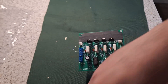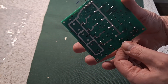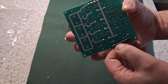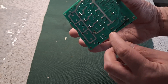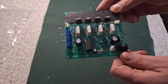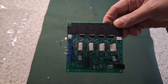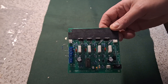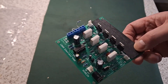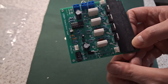So I removed these diodes here and just left one in place. I soldered a link from the negative terminal of the DC jack to the negative rail of the main power rail. For some bizarre reason it's designed to work off 12 volts AC. Here are some instructions but they're in very badly translated English. So yeah, if you need to run this on DC you need to remove these diodes, or don't solder them if you've got the kit.